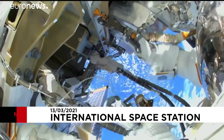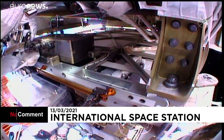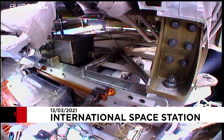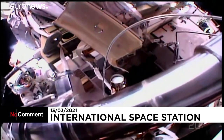Okay, let's go ahead and mate that hopper so you can mate the QD extender to the vent tool adapter. Okay, that's a good config. The QD is closed as expected, so verify that it's ready to mate. Check that the detent button is up and the forward white band is not visible.